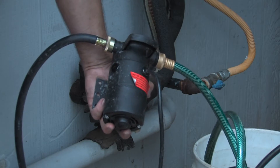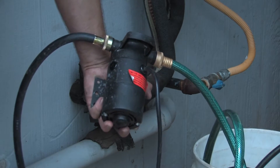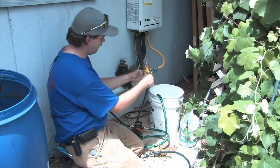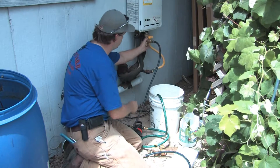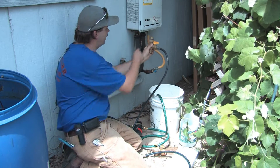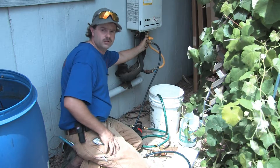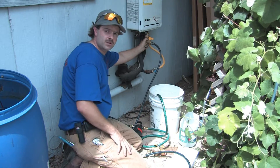You hook your hose into the inlet on that, and then the outlet hose — which is a basic standard washing machine hose — goes to your valve that goes into the cold side of the tankless water heater. You can see the blue indicator here indicates the cold side, so it makes it visually pretty simple to pick out which is which.